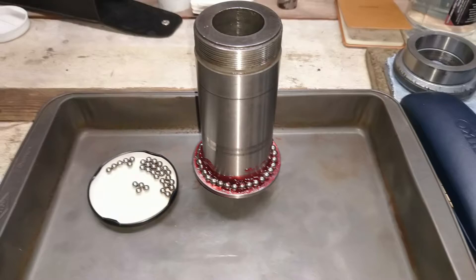I only have one photo taken with the work-holding head dismantled, and it shows the central rotating shaft — bored in my case for four Morse taper — and the loose ball bearings that allow it to run freely. At the top there's a large thread that engages with the engraved nut seen earlier. In the top right of the picture you can see that nut and the spacer ring which fits in there. When you do that ring up, it pulls tight against the bearings and takes all the end float out.